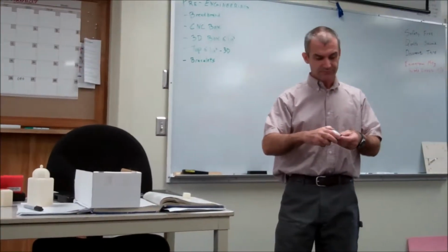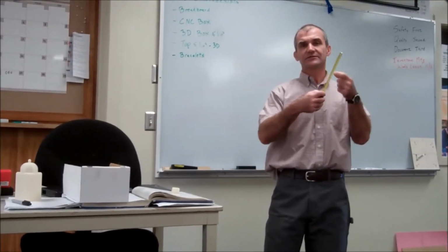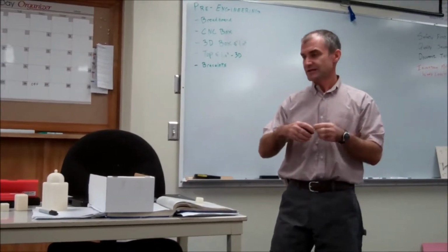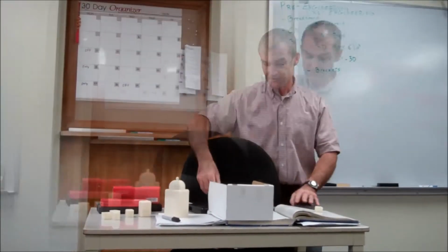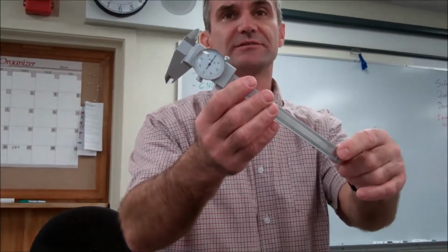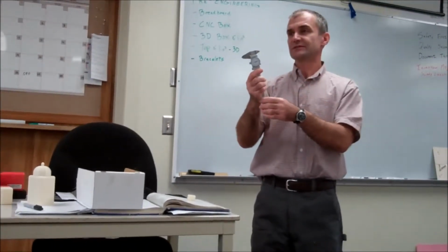Then from this kind of tape, you go to a cabinet tape, and you count up the increments on here, and there are 32 in the first foot. So this is accurate to 1/32 of an inch. And if you're still staying fractional, dial calipers and fractions, every little tick marks a 64th of an inch. But after a 64th of an inch, you go to thousandths of an inch.